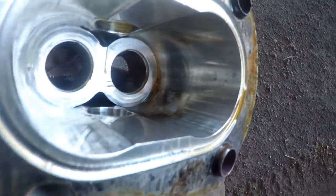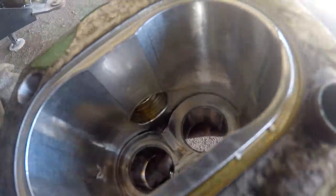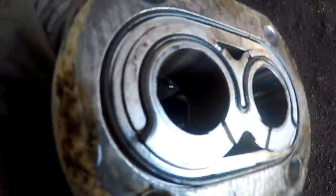Let's get out here further in the light. See where the ridge is right there? Can you see the ridge? And the heat marks on the housing. That one's not as bad as that one is, but it's junk. See how the bushings are worn on the end? 369 hours. He changes oil at 250. But you wonder though, I don't know. You wonder if these guys hooked this thing up to a closed center system and ran it on open center. That's what you wonder.